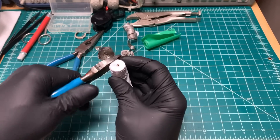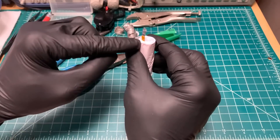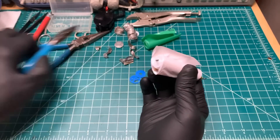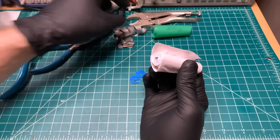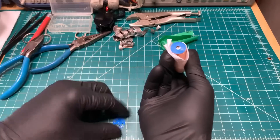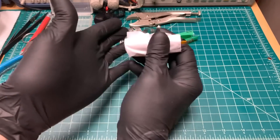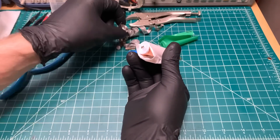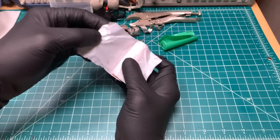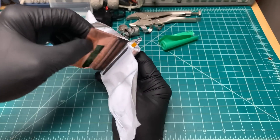If I can not cut the can and just cut the tab — okay. So you've got the positive connection coming out of the roll and the negative connection coming out of the roll. And there are unbelievably sharp pieces. There's an insulator at the top, at the bottom, and another one at the top. That helps keep the roll from touching the bottom inside of the can and short circuiting anything — same with the top too. And then there's an insulator on the outside.